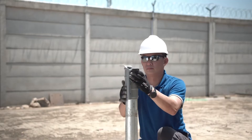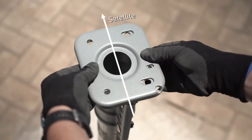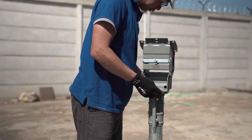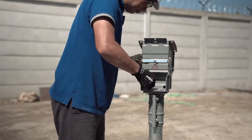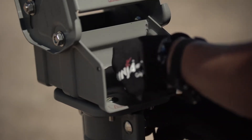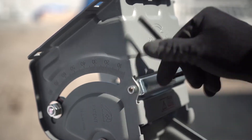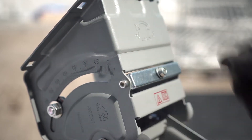Place the brackets on top of the pole and tighten with the four bolts. You can now place the flat piece on top as indicated. Place the mount on top of the platform, correctly oriented so that you can see the fine azimuth adjuster fixation hole. Gently tighten the mount with the four bolts. Place the fine azimuth adjuster and screw it into the mount. From here, you'll be able to adjust the elevation — loosen the two lateral nuts to allow the mobile piece to slide as you turn the bolt located at the back of the mount. Once you've reached the required angle, tighten the bolts again.